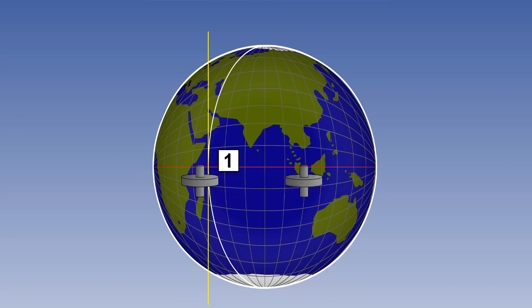Whilst this one shows that if the gyro axis is pointing north, there is no Earth rate at the equator. This horizontal component is, as we showed earlier, 15 times the cosine of latitude in degrees per hour. At the equator, we get the full 15 degrees per hour when pointing east, and 15 times the sine of the latitude in degrees per hour when pointing north. This is 0. At any other latitude, we get intermediate amounts, depending on the latitude.